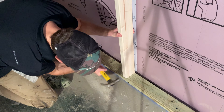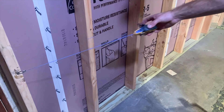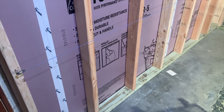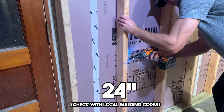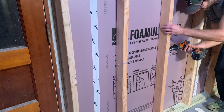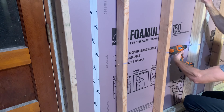Before we can actually add electricity we have to insulate and frame the basement, which I did in the last two videos. After framing, the first thing I did was mark 16 inches off the floor with a chalk line — that indicates the bottom of the outlets. I also marked 24 inches off the floor, which is where I drill the holes to run the wire above the outlets. I'm running 12-2 Romex cable, so I'm drilling half-inch holes through all of my studs.